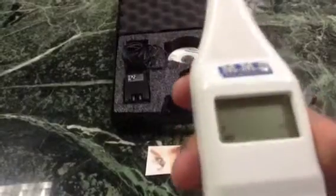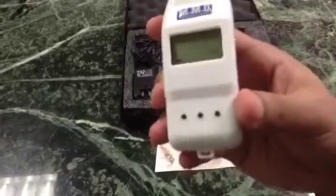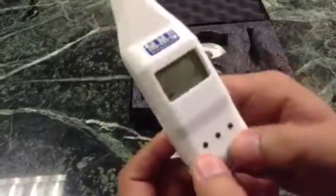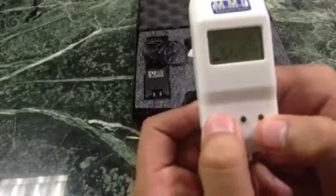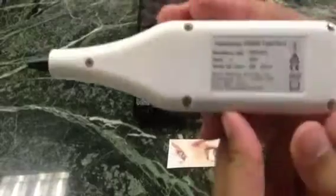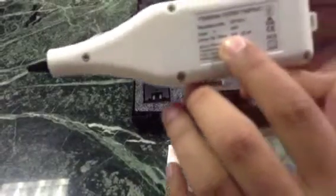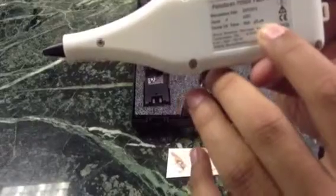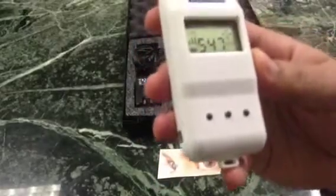All right, as you can see, we have the OD flashing in the upper left corner. One great feature about this unit is it's self-calibrating. So I'm going to go ahead and self-calibrate it. Here are the three buttons the unit has. I just press the left and the right for a few seconds, hold it down, and let go. So 547. I'll take a look at the back here — it says device calibration value 550 microns plus or minus 15 microns. So 547, that's within the calibration. We are good to go.